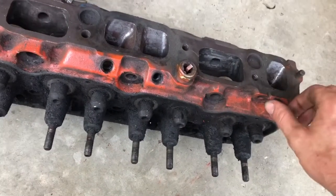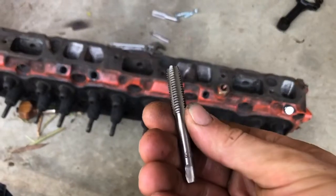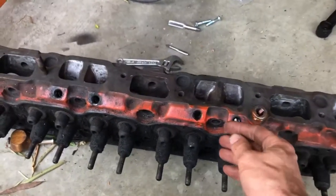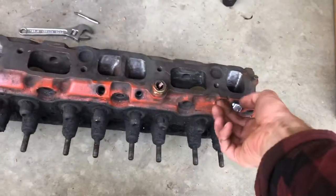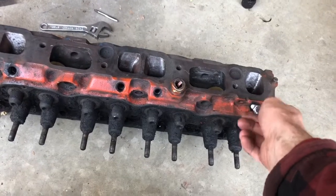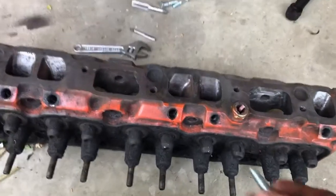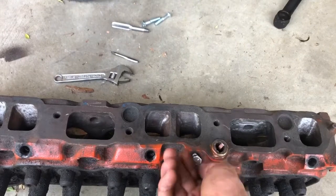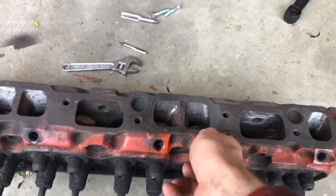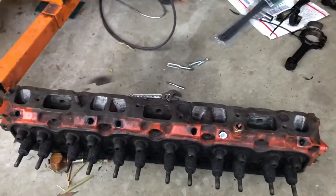What I've done — you see this bolt sitting here — I took a regular run-of-the-mill tap, a 3/8 tap, and I just took a drill bit, very lightly cleaned it up, and ran my tap through all the way. What you can do is get your 3/8 tap and a 3/8 bolt, ream that out, run your bolt all the way through to get it bottomed out and good and tight. Once you get it tightened in place, you can come in there with a die grinder and smooth it all out.